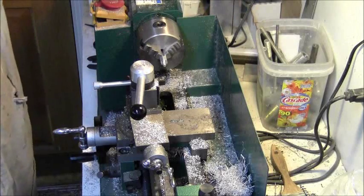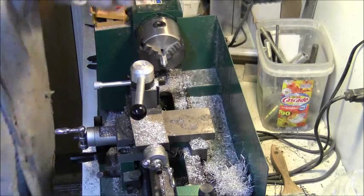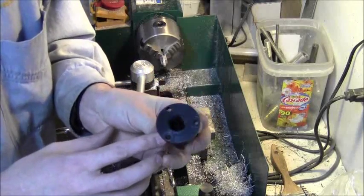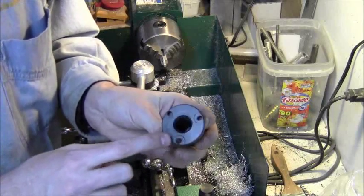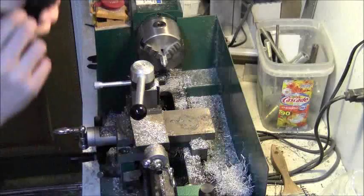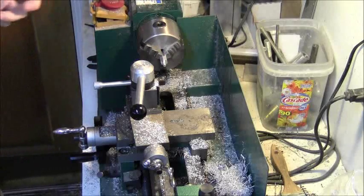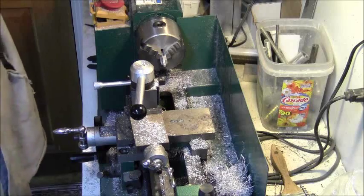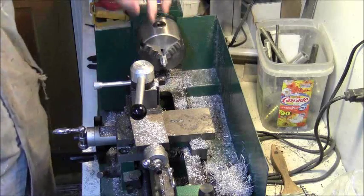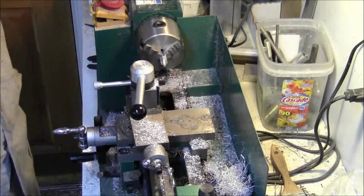I'm also going to leave a little ring, kind of like a washer, and that's really the thickness I'm most concerned about. I learned that a hex digs in really badly — see the rings around the holes there? That's from the prototype's hex head having too sharp of an edge; it dug in and sort of cut. I don't want that to happen anymore, so I'm basically going to be building in a washer. I have to decide how to do this operation — the idea is to repeatedly set the thickness of that washer area. It doesn't have to be perfect, but the closer the better.